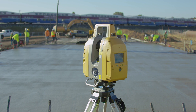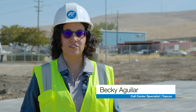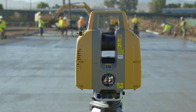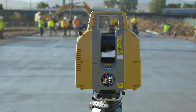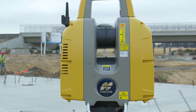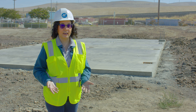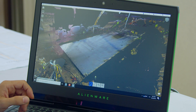Today we're using LiDAR, a light detection and range finding technology, to scan wet concrete at this construction site. This LiDAR is a laser beam, kind of like a laser pointer but a lot faster. It shoots a point, that light bounces off the surface, we get a return, and it creates a point. We're shooting hundreds of thousands of these per second, and it creates what's called a point cloud.